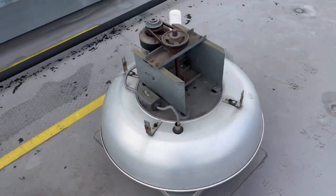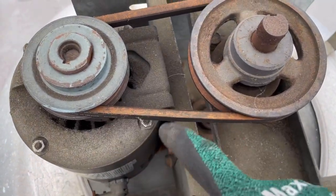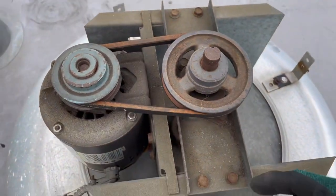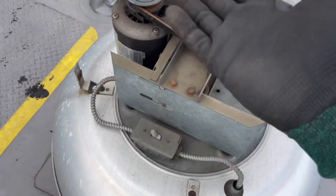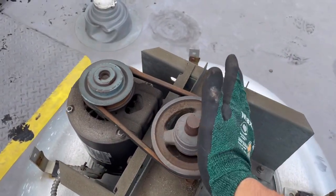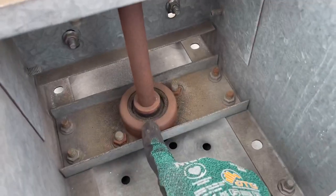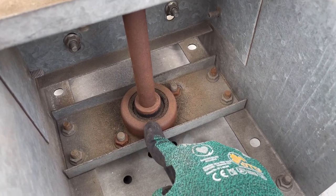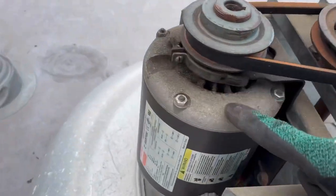I will take the cap off and I will show you guys what I mean by the motors locked up. I had taken the lid off and as you can tell there's this rust look to the belt. When I was here on the first maintenance, I noticed this, so instantly in my mind the motor hasn't run in a while. Well, it is free. These bearings are permanently sealed so there is no greasing or oiling, and same with the motor itself.